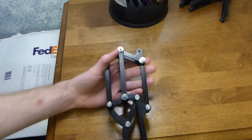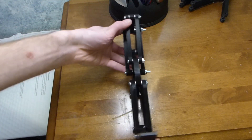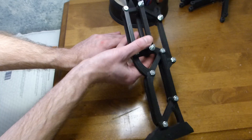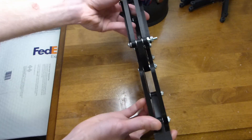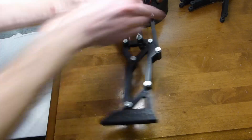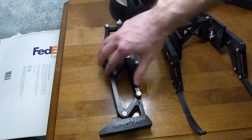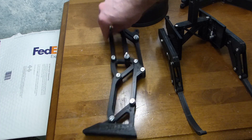This is meant to go with a hip section up here that can allow the leg to move in this direction, and the hip will allow more travel in this direction. With these legs, the main idea I was shooting for was relatively simple linkages and full, independent control of foot angle, lower leg angle, and overall full leg angle. This one is meant more for a robot that uses a human-style leg and human walking style.